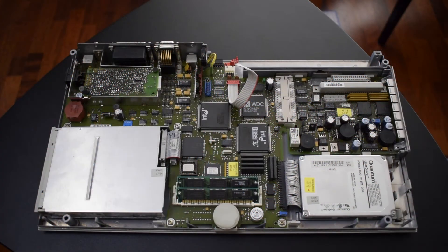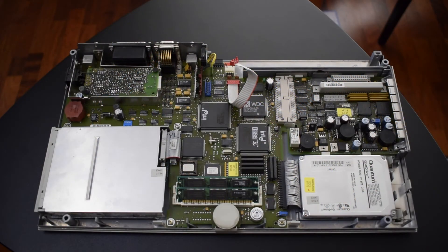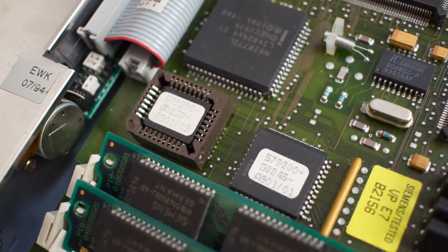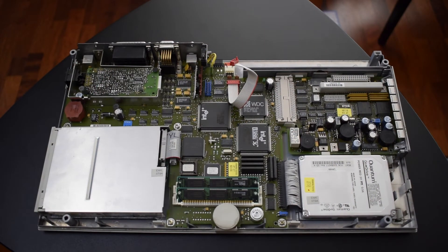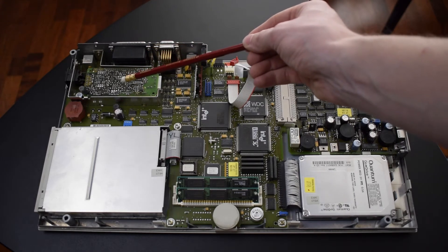This large proprietary removable board is the interface to the SIMATIC S5 production line. Two EEPROMs — one socketed — and both are loaded with system software. All legacy ports are here at the back as well as the power supply unit, which is well isolated and shielded.